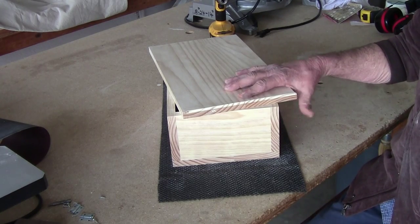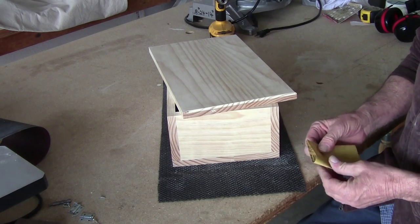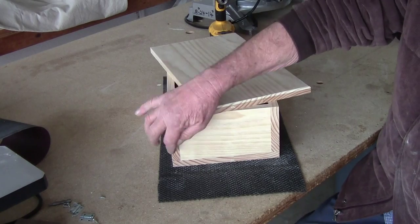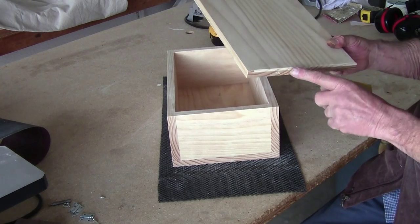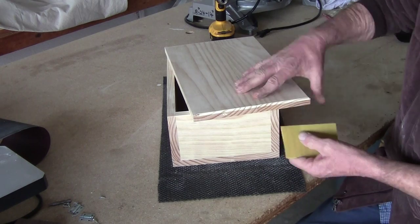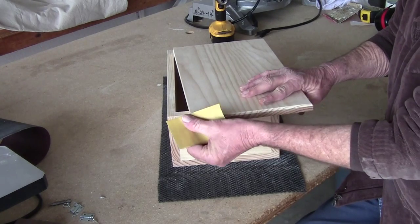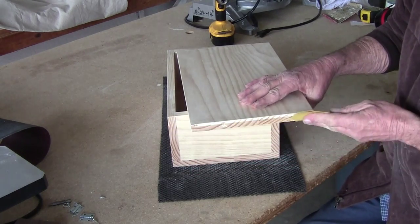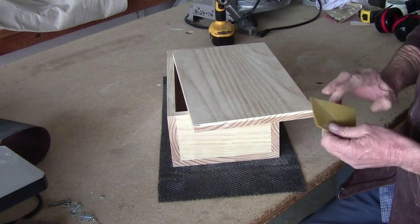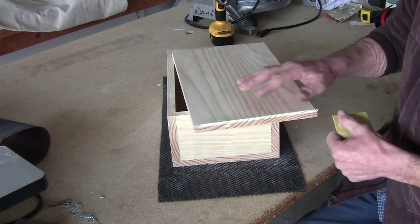Did the whole box with 320 and 400. Now take another piece of 400 and go around all the edges, sanding them so they're not quite as sharp. Do all the edges on the entire box - just like so, don't need to do much, just rounding the edges. Be careful not to put the sandpaper flat on the face or you'll scratch it - hold it at an angle so you don't accidentally put scratches across the surface.